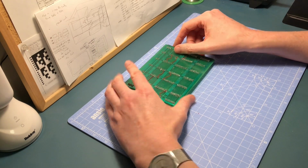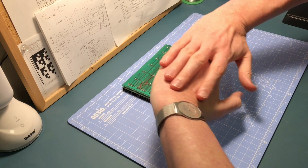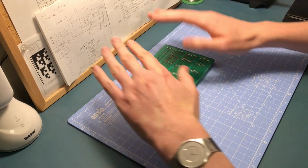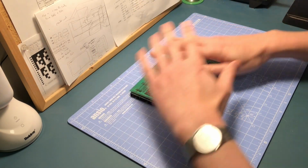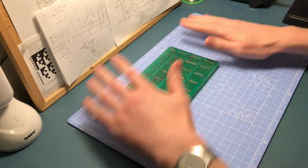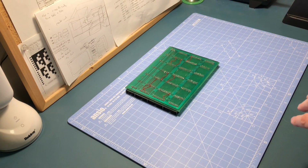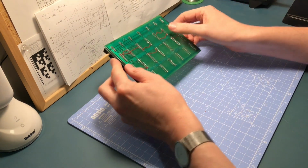an overhead projector sheet, like an acetate sheet, and you can print out two of them and overlay them so you get a nice dense image. And then use UV, so you actually have boards that have a UV sensitive layer on them. Basically what you do is put the sheet on there, have a light box that will expose it, and then you can wash away the bits that haven't been exposed.